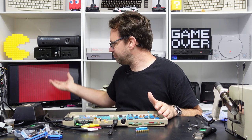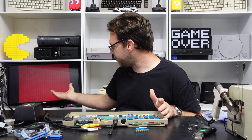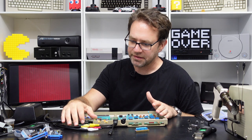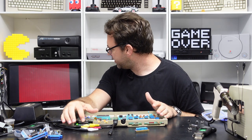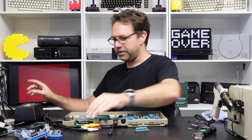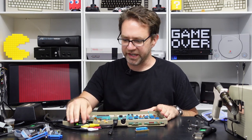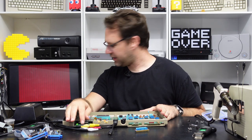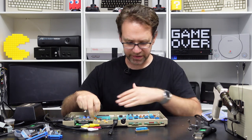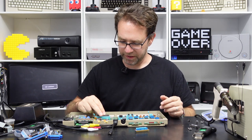As you can see, this is not what the dead test is supposed to look like — we're still supposed to have a black screen at this point. This cartridge actually has a little reset button, and I can see that when I hit the reset button this pattern on the screen actually changes slightly, so I can tell that the CPU is being reset and in theory that part's working, but the VIC is holding up the rest of the system and it's not outputting what we want to see.